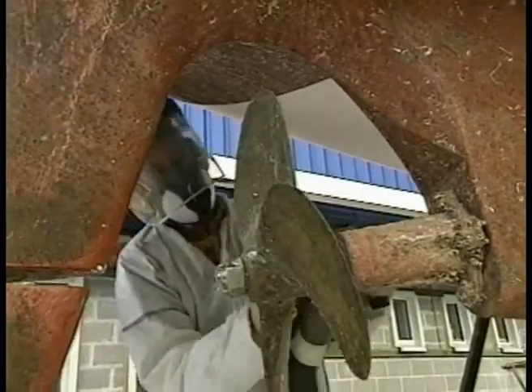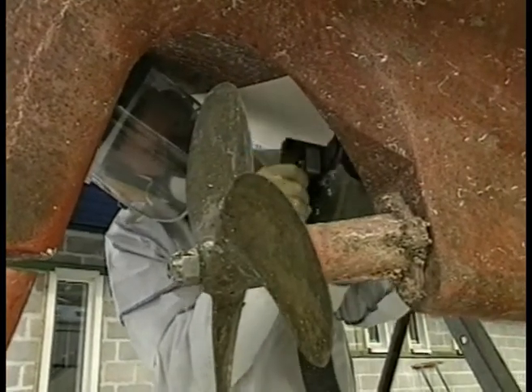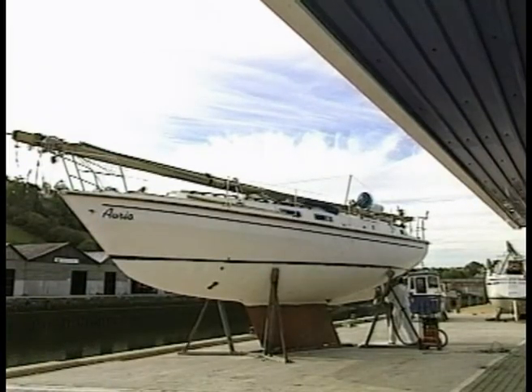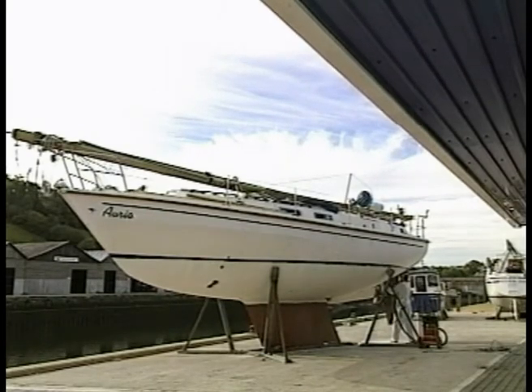This side of the boat is now being finished and is ready for pressure washing, drying and rebuilding. It's often useful to lightly sandblast the hull after peeling to open up the surface for drying and adhesion. It will also remove any deeper soft laminate. It's stressed however that the absolute minimum pressure, grit and time is used.